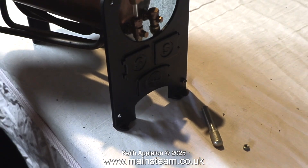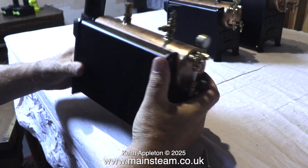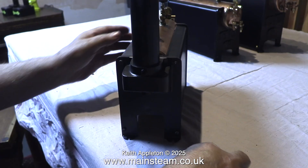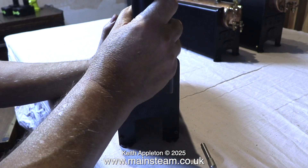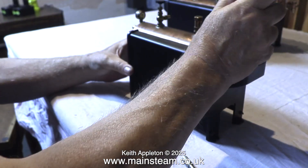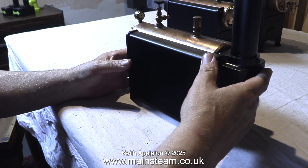This is not going to happen now though, because I put a nut on the end of the rod. Here, once again, I'm demonstrating that the boiler does not sit square on the table — and it's not my table that's the issue; it's quite a strong, flat table. The solution is to slacken off the nuts, twist the boiler frames until they sit square on the table, and then retighten the nuts on the end of the rods. You may be wondering why I'm working on the kitchen table — it's just that there's more room; I have some other jobs in progress in the little workshop.